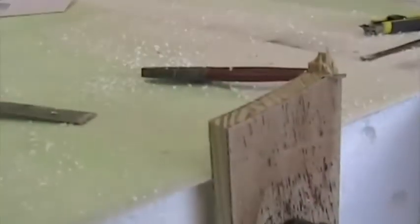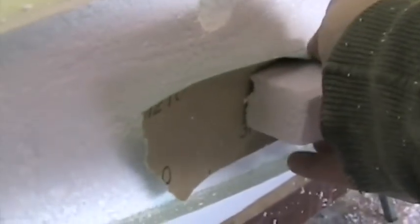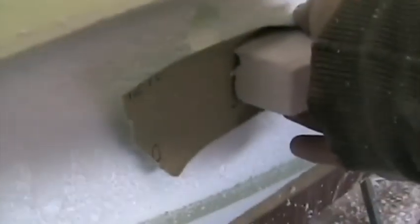And then I've used it like that, working all the way along to get a fairly even removal of 15 millimeters of material. I then also managed to lift the peel ply with this blade and ripped it out, leaving this edge clean and ready for bonding of the glass. Final task is just to sand this whole area nice and smooth. We'll then apply a micro slurry and put on the layers of glass that form the root rib.